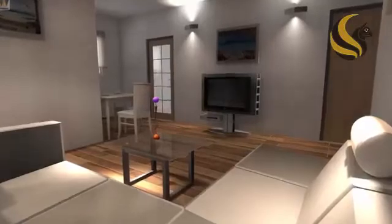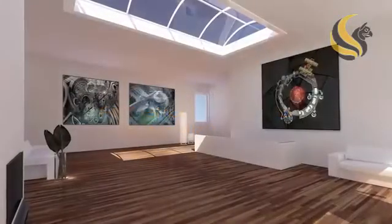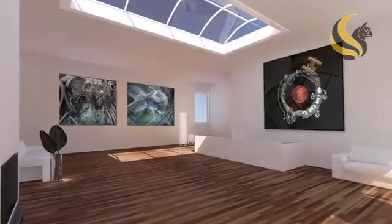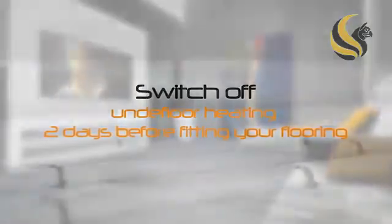Please note, it's important that you do not fit the final floor finish onto a warm floor. So, if the underfloor heating is on, please make sure that you switch it off at least 2 days before fitting your flooring. We trust that this short video has given you an insight into installing underfloor heating.